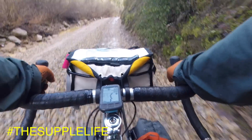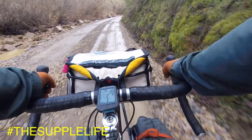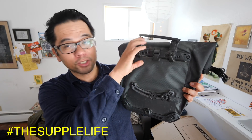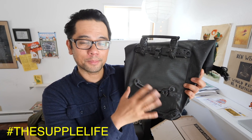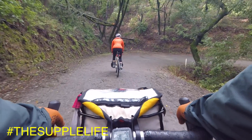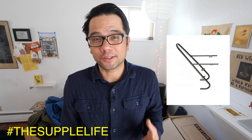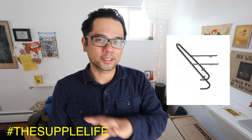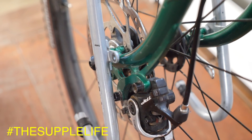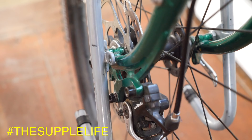During our recent California tour, there were a couple of stretches of road where I wished the Ortlieb Panniers I typically use had a bungee connection. This is the standard hardware — it's got adjustable hooks on the top and sliding hooks on the bottom. About 95% of the time they do awesome, but there are a handful of instances when a bungee system is better. Primarily when the terrain is super rocky, if you're using a front rack like the Tubus Terra rack where it's kind of an S-shape and it doesn't box in the bag. And more specifically, when you're using the Terra rack on a modern bike with disc brakes, there's just a lot going on near that hub area — the fork itself, the disc brake caliper, the tubing of the rack. It turns into a real challenge to slip in that lower hook.